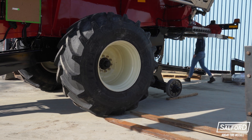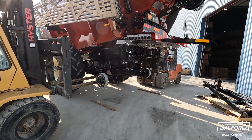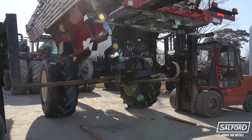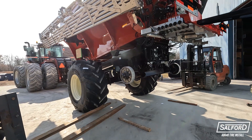The same process can be repeated for the back two tires. Start by lifting the back of the axle until the axle lockout pins can be set in place. Once the pins are set in place, the forks can be lowered and the rear of the walking beam suspension will remain in an upright position.